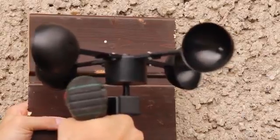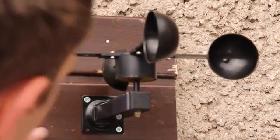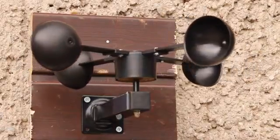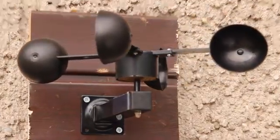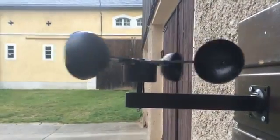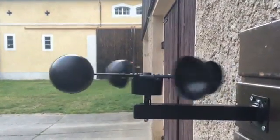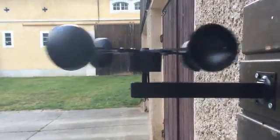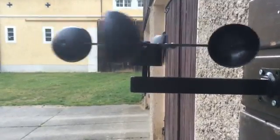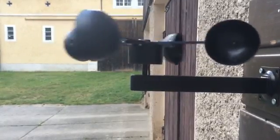Internal energy management makes sure there is always enough energy for essential operations. The energy management will change the wake-up time on demand — the interval at which the device transmits sensor values such as temperature to the central controller. The wake-up interval can vary between 5 minutes and 1 to 2 hours. On a morning after a long winter night, it may even reach 5 hours in extreme cases. The button operation will be deactivated as soon as the energy level falls below 30%.